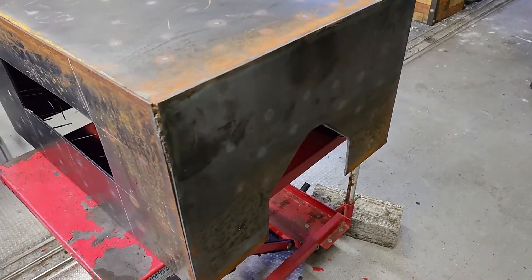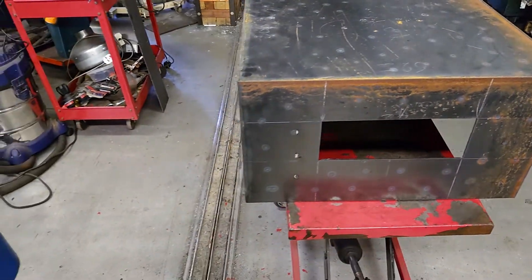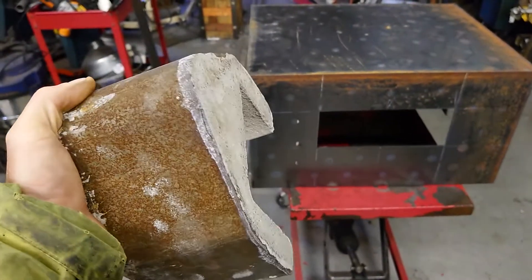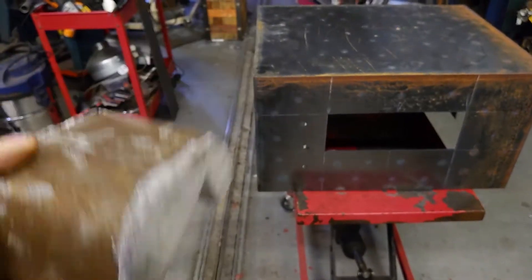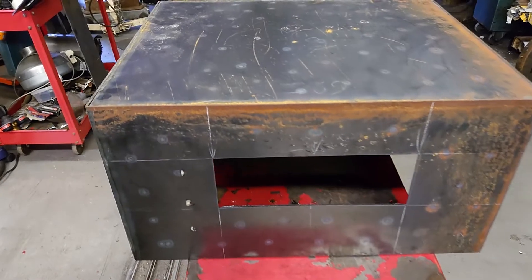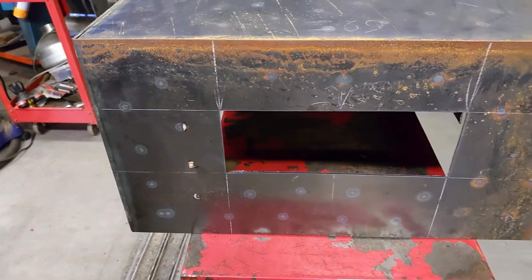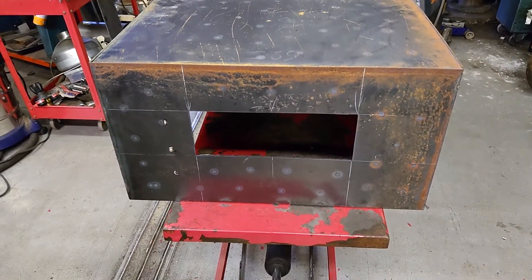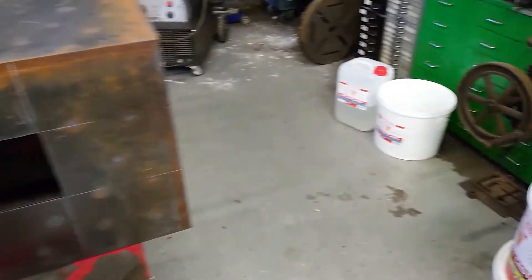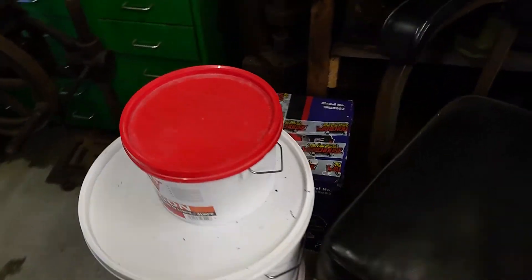We've kept the original shape so we can use our doors - these ones here, which are made from an old car ramp for the skin - and then the new high temperature refractory which isn't going to melt. It'll be a lateral ribbon burner this time, so we're not heating in a direct oxygen-rich bit of the atmosphere, which should make forge welding a bit easier.